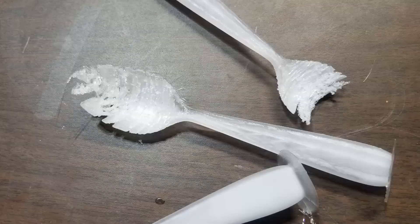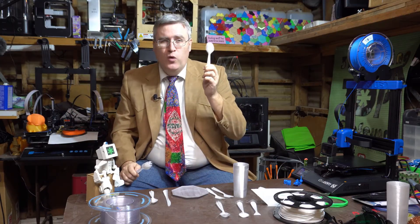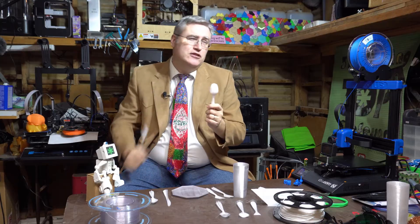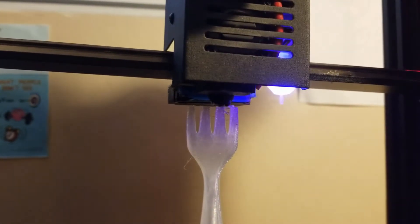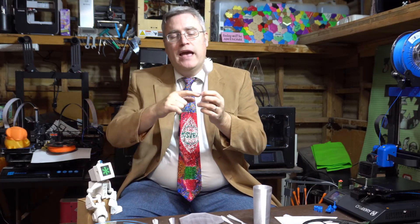Speeding up had taken us from being able to 3D print amazingly detailed objects to not so good. And this brings us back to the spoon. It was in fact slowing down the 3D print that took it from a crappy print that looks like a feather for no good reason to a relatively good, solid, and pretty 3D print. I had to try a lot of things along the way — printing the knife, fork, and spoon one at a time, turning down the speed settings, turning down the minimum layer time to make sure each layer was cooling, and Z-hop ended up being a huge save. Overall, slowing down and making the print take more time per layer is what stopped it from wiggling too much or not being solid enough as it got taller and thinner.